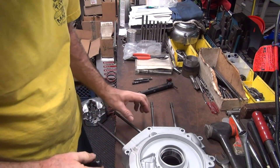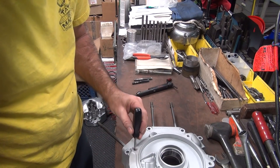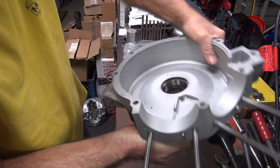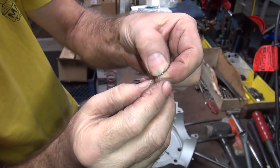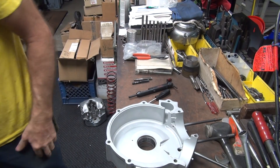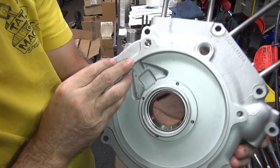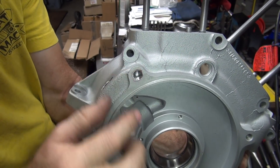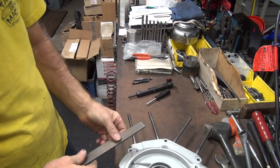I just take this and push the tang down — you hit on the base of the tang and go like that. The tang should break off cleanly. Always make sure you find your tang — you don't want these inside of your motor. Make sure they wind up in the trash can, not laying on your bench. So that now is tangless; it's installed. I'm going to file across that to make sure there's no burrs on there.